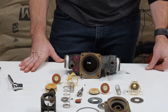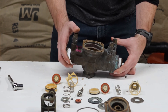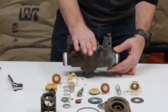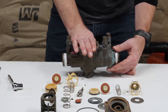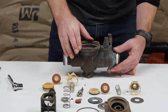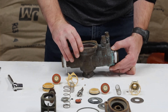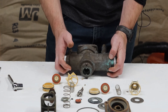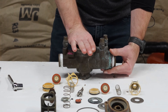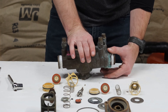Now that we have it completely broken down, it is pretty simple. Like I said, I don't have the best luck with these — I typically replace them. The tolerances are very low on these, so if it does get frozen, that o-ring on your checks won't sit inside the seats very well and you're going to end up having a drip and a problem anyway — they may not pass. So instead of taking all that time to repair it, my recommendation is to go ahead and just replace it. Even if you put a brand new kit in, if you put a brand new one in you're going to get more life out of it for a little bit more cost.